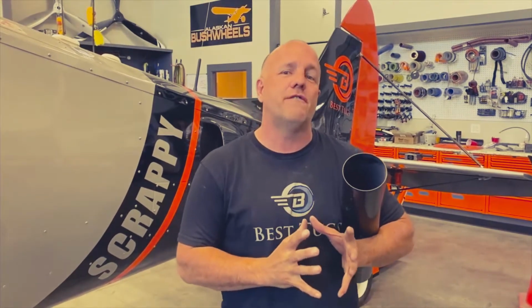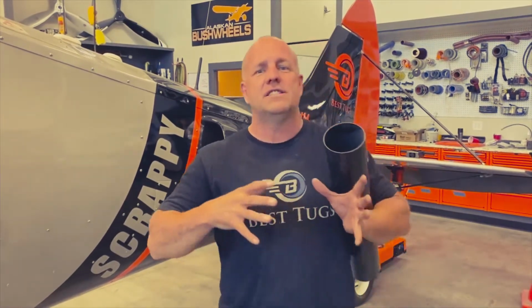Add on top of that, in an aircraft, you get the benefit of always flying around. We actually make ram air pressure just from flying. So you size an air filter not like a car, you size it as an aircraft would, and there is a big adjustment for that. So I do know that this air filter works on this engine.